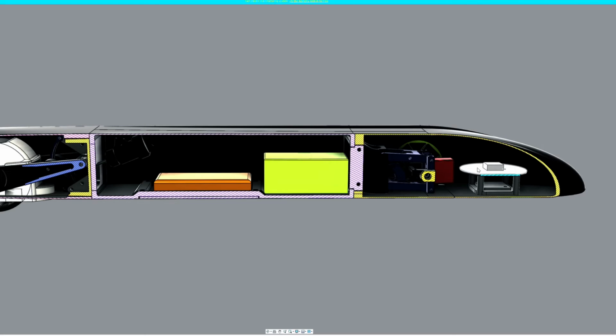So what I've done is I've gone ahead and added a ground plane, which is a little circular aluminum plate here that the antenna goes on top of. And what this does is it helps to deflect some of those reflected radio signals that are coming up from the concrete itself. And it's actually vastly increased the accuracy of my cheap little GPS module. I am going to go to a better GPS so that I can get more reliable readings and do some other cool stuff, but I think for my purposes this is plus or minus a half a mile an hour, so more than accurate enough.